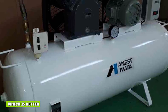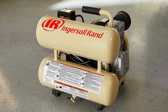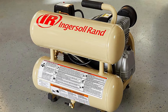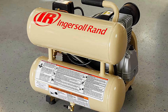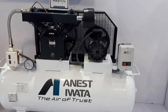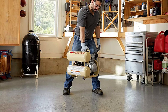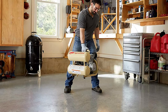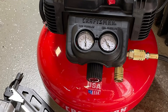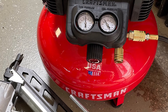There was a time when oil-lubricated air compressors were considered the best, but technology changes and opinions have to change with it. Early oil-free air compressors weren't the best for heat dissipation and tended to produce hotter air, which increases condensation of water, and hot air is less dense. They were also much noisier and tended to be less durable. To overcome some of these disadvantages, most oil-free air compressors now utilize two pistons, reducing heat and noise.